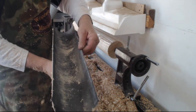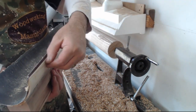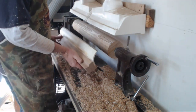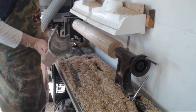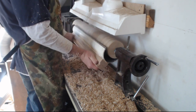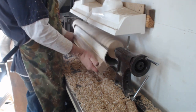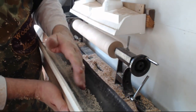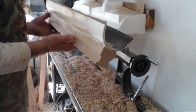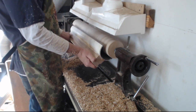And this, it's got leading edges. You don't put the paper just right up to that hard edge because it'll catch and rip your wrists off. Whereas if you've got these round lead-in bits, as it goes in, it touches that and then it'll feed into the jig. That's the theory. And because it's going that way, the sandpaper abrades here, throws it up into here, which is an assist to the sucker. So if you look down here when I finish, there won't be any dust. You've got to hang on to it though.